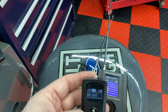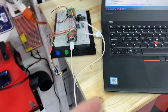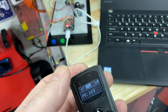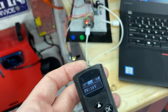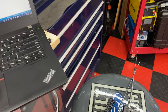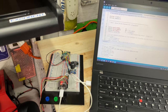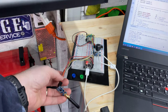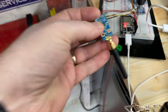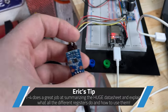I don't understand how that could have ever worked. I can replay-attack this thing, and I know the frequency now — it's 433.900 MHz. So I can see if this is set correctly; maybe one of the registers is set wrong. There are a whole lot of registers that the library sets, and the datasheet for this thing is 109 pages, so it's significant.